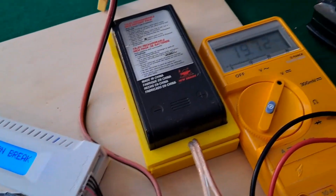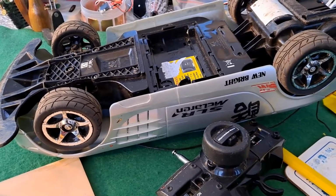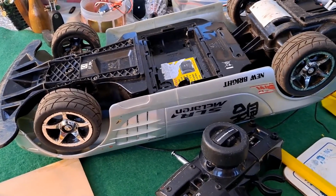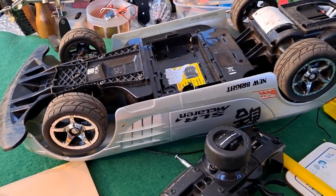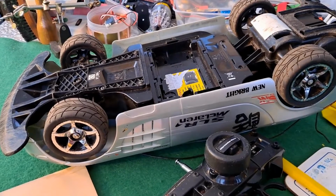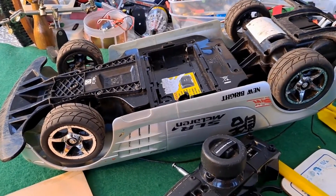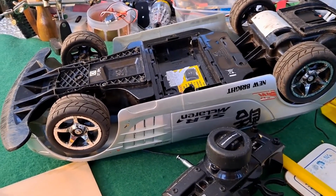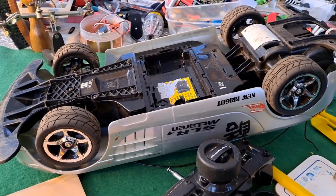So I guess we're probably going to have to convert that to a LiPo. And I don't have any. What would that be? That'd be a 5S, I think. 5S is 18 volts. Let's think. Yeah. 3S, start at the beginning. 1S, 3.7. 7.4. Brain's gone. So 14.8 for a 4S. 16, 17, yeah, about 18 volts for a 5S. Or maybe a 6S. 6S would overpower it. But I don't have any 6S.